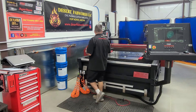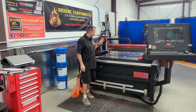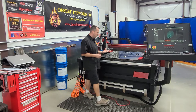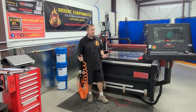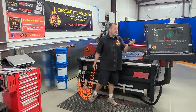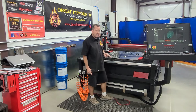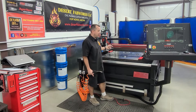When I've finished cutting a piece — like this piece here for LAPD — it's got some remnants from the cut on it, kind of dirty. So I can come over here, get my water nozzle, and I've got a little remote control keychain that turns on the pump. It draws water from the table reservoir and puts clean fluid on top so I can rinse off the piece.